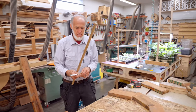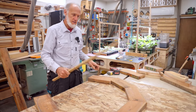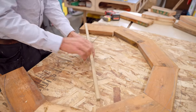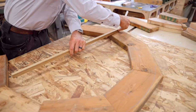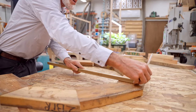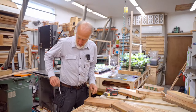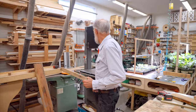Here's our stick again — you need to make sure that screw's sticking out long enough, because now we're going to have to draw on top of these blocks and we need some height. So put it right where you had it before in the middle when you drew the arc first. Just line that up, take your pencil, and strike an arc all the way around here. Hold your pencil solid against the end of the stick and make a mark all the way around. Now it's time to cut them. You can do this with a jigsaw — works just fine. I'm going to use a bandsaw just because I've got one.